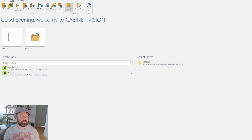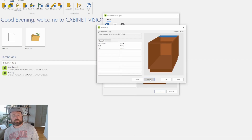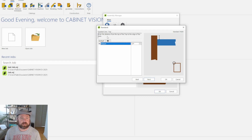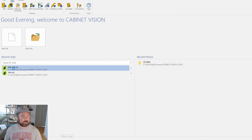Let's go ahead and fix that first. We'll close out and save, then come back up to Assemblies. I'll go to Schedule, make sure that under Assembly we have the Cabaneo 12 millimeter frameless selected, then come to the Exterior Case and double-click the top. There's a parameter here — a distance — that's the three-quarter inch distance from the top to the edge of the case. We don't want that, so let's zero that out, hit Next, and hit OK.